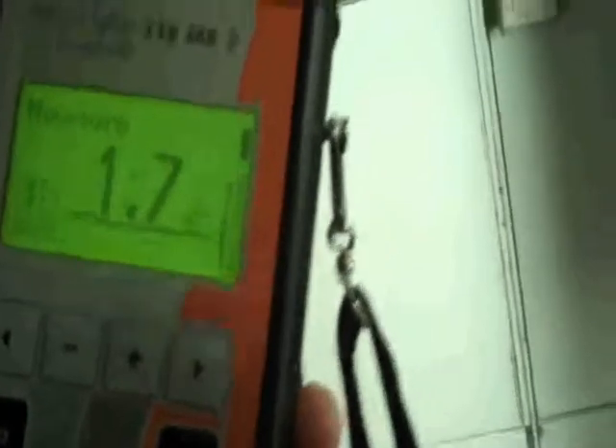Taking a reading right in the middle of the part — took 19 readings. Pressing the go button: 1.7 mils when it comes out of the oven on that part — a cured film. Taking another set of 10 samplings to calculate shrinkage: 1.7 mils. We're going to follow this part into the oven and test it with the 456 to give you a correlation between the dry film and the non-contact powder thickness gauge 550 readings.